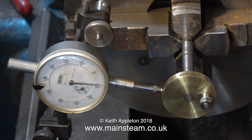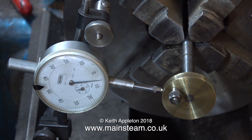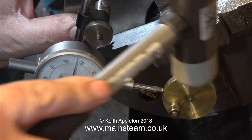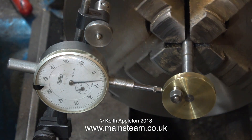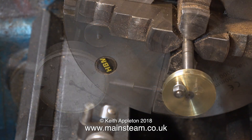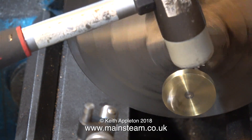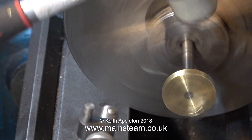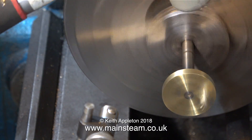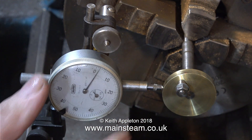You'll notice that I'm holding this crankshaft in my four-jaw self-centering chuck — that way the pressure is evened out on the crankshaft. I'll just hit it again to make it worse. And now the crankshaft is even more bent than it was in the first place — I'm going to straighten it. I'm repeatedly hitting the crankshaft with the soft hammer, but this is not the way to do it either, because you need to hit it, look at it, hit it, and look at it. Because on one of the hammer blows it ran true, then I hit it again and it didn't run true.